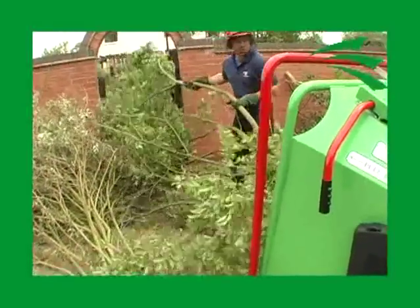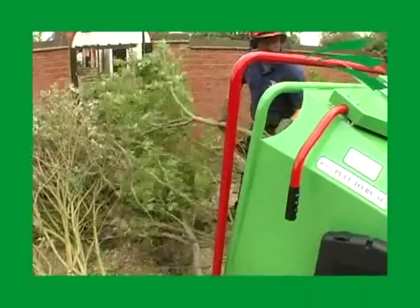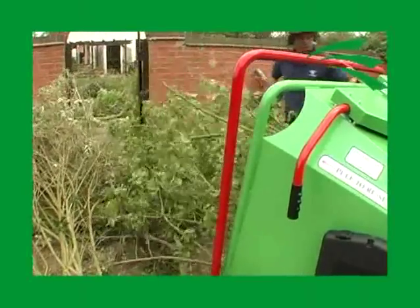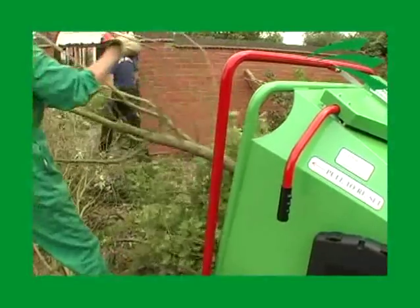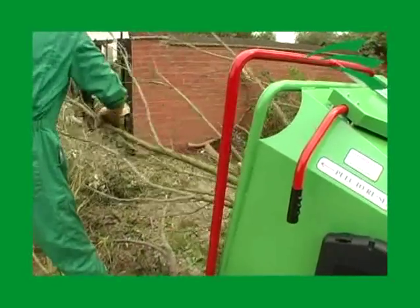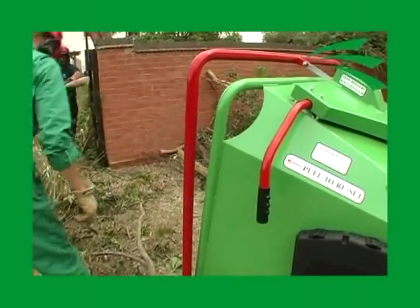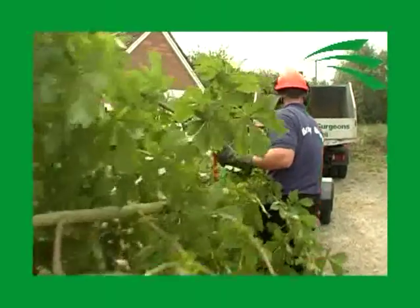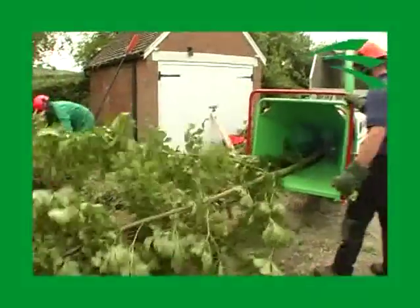The Arborist featured here is fitted with a rugged 26-horsepower 3-cylinder water-cooled diesel engine with a heavy-duty air cleaner and radiator screen. A 35-horsepower water-cooled 3-cylinder diesel engine is available as an option. This model is fitted with the optional twin in-feed rollers and has a braked highway-compliant chassis. The weight of the 26-horsepower diesel version is under 750 kilograms.